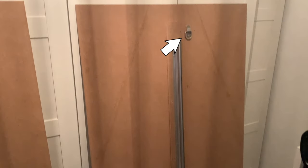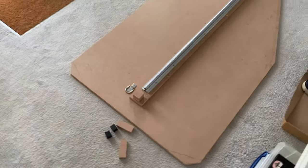I actually found this bit the most difficult — lining the bearing blocks up with the linear rod. To do that I had to make a template out of paper and mark out the holes I would drill so that the bearing blocks would fit on the linear rod and be perfectly straight. I then attached the D-rings on that side and the opposite side, just so you can attach the springs.